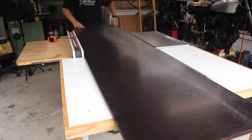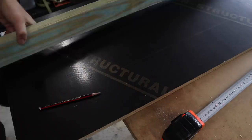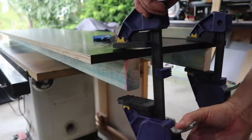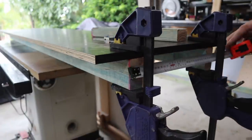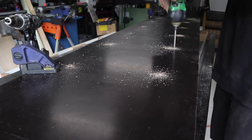I'm ripping down the table top at the moment and the material I'm using is film-faced plywood. It's perfect for this application because it's kind of water resistant, so if any coolant or oil gets on it, it's not really going to affect it. The size I went with is 2 meters 50 by 480 millimeters wide.